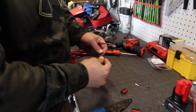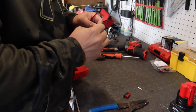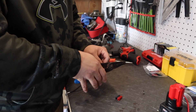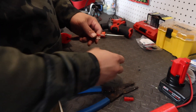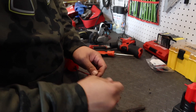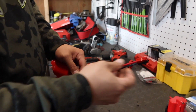So the first part, we're going to twist these up and put these little connectors on and just crimp them down. Once those connectors are crimped on, we're going to do the same thing on the quad side. Then we can take these connectors and push them in — click — and now that's locked in there. We'll do the same thing with the other one, and now those are in and we've got half the system done.